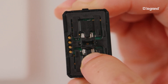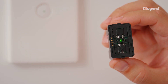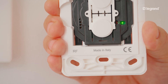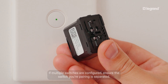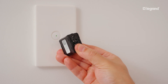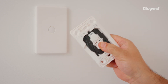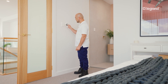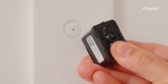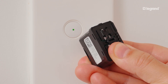Briefly press the button on your wireless switch model. The light will blink green, turn solid green and then turn off. Press and hold the button on the wireless switch. While holding it down, tap the wireless switch firmly against the smart switch three times in quick succession as shown. The LEDs on both the wireless switch and the smart switch will blink blue in sync. Shortly after, the wireless switch and the smart switch will display a solid blue light and turn off.